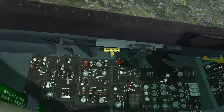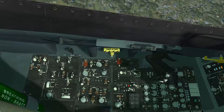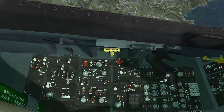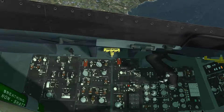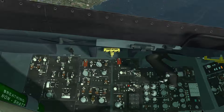If you want to choose a specific channel for some reason, you could put it in the manual position and then use the frequency select knobs here to change the frequency to whatever you want to use. When you're in manual and in the backup position, you'll be able to talk on the selected frequency. Normally what the manual position does is it allows you to assign a manual UHF frequency to a preset channel. So if you had 246.0 set in here, you could flip up the cover — underneath there's a little preset button — press and hold that, and it'll assign 246.0 to preset channel 5. But we can use it to just talk on any UHF frequency we want to.